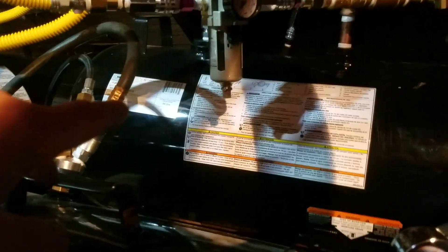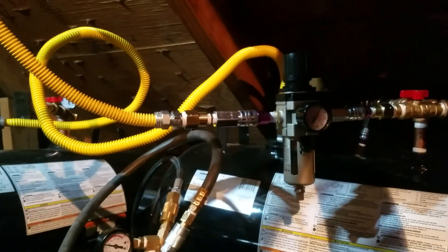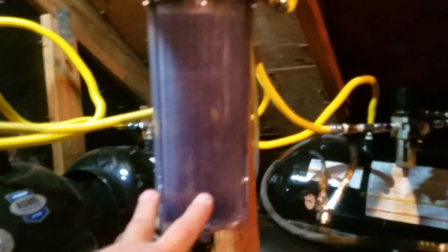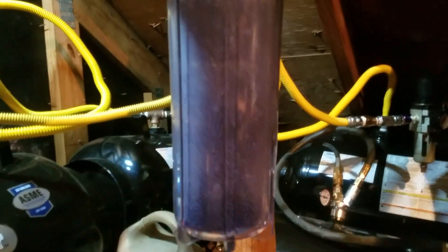Out of the last tank, I've got a water filter — some kind of crap filter that hasn't dripped out one automatic drip. I've got that pressure set at 100 PSI. That line feeds into — before it goes into my air reel — an idea I saw on YouTube about taking an under-sink water filter and doing some reverse engineering, putting desiccant in it, which absolutely dries my air. That's going to be outstanding for my plasma cutter.